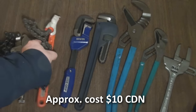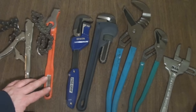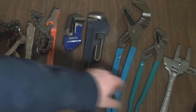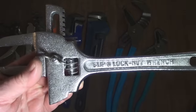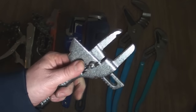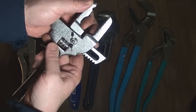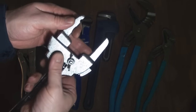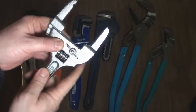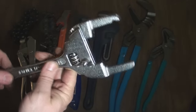If all you've got is a chain wrench or a locking chain wrench, this kind of stuff will obviously do the job, but you're going to have to be very careful — you're dealing with plastic fittings and they don't take a lot. There's also a specialty wrench here called a slip and lock nut wrench. I've had a lot of use for this in the boat building industry — I use it on plastic through-hull fittings. It's just a wide-jawed adjustable wrench. It's very light duty, so you're less likely to slip and damage a new fiberglass boat when putting in through-hull fittings.